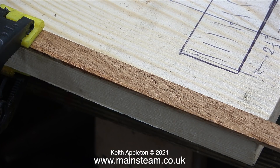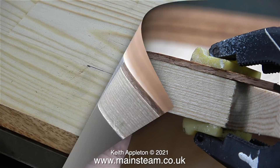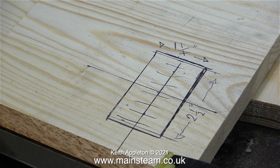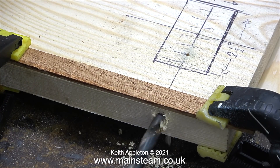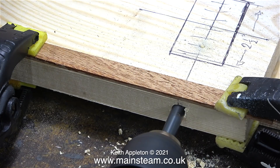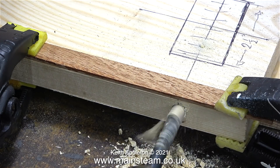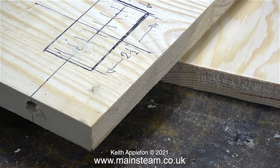I need to drill a hole from the edge of the baseboard into the area I'm going to cut out, which will house the drainage sump. To arrive at this dimension I need to clamp a piece of mahogany planking on top. The distance from the top of the mahogany plank to the bottom of the baseboard is two centimeters. Using my small Proxxon motor tool I'm drilling a hole in the sump area, and now using a drill bit one imperial size above 5/16 of an inch, I'm carefully drilling in from the edge making sure the drill is square.